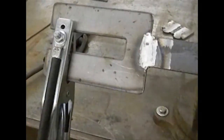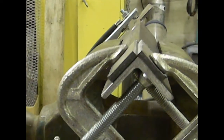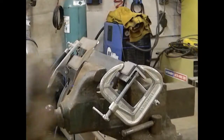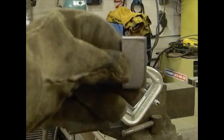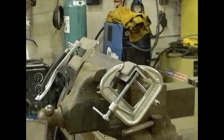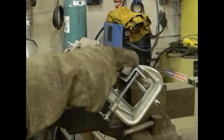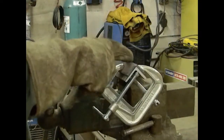Here's another configuration — and that is going to be for a corner weld. These are the two pieces I'm welding together; this is 2 inches by 1 inch by 3/16ths. I'm going to be using a 7018 1/8 inch rod. Now, keep in mind: when you have it set up like this, you only want to do your tacks on this jig — you don't want to weld the full weld.